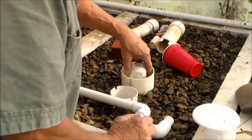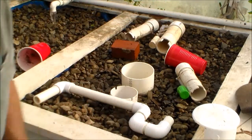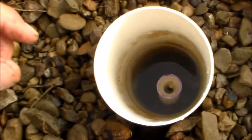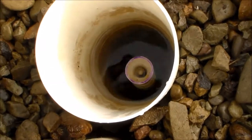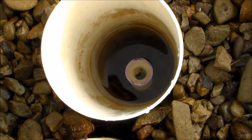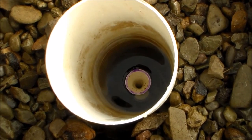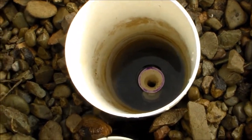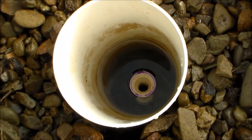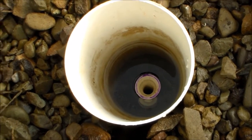Here's the bell I'm operating with. Let me give you a look inside. You can see the standpipe there — it's a half inch standpipe with a flare, and that should allow the water to start its siphon. So I went from a three-quarter to a half inch. With these, a lot of times you have to have a restriction as it's flowing down there to kick it into a siphon. But that didn't do it.